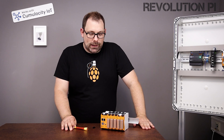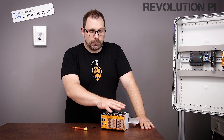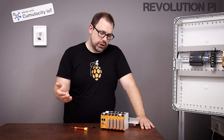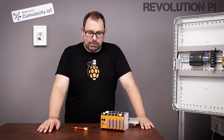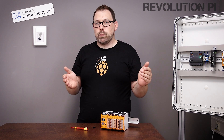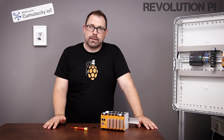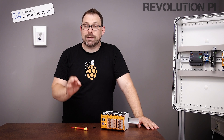I promised we would talk a little bit about use cases. With a lot of inputs comes a lot of computation that you want to do. Maybe you want to do some number crunching like Fourier transformations on a lot of high-frequency inputs. Some people like to attach touch screens to Revolution Pi to have an HMI. The problem always was that running a browser in full screen needs a lot of memory — now we have a lot of memory. So if you use CodeSys or Node-RED to create an HMI, go ahead. You will have a lot of fun — I tried it, and it is really cool.